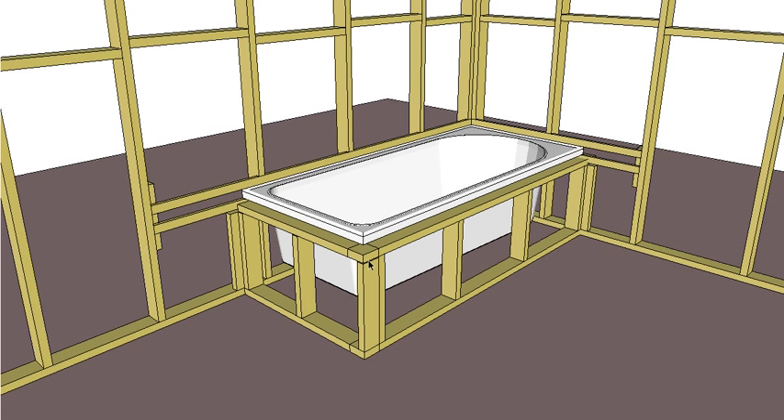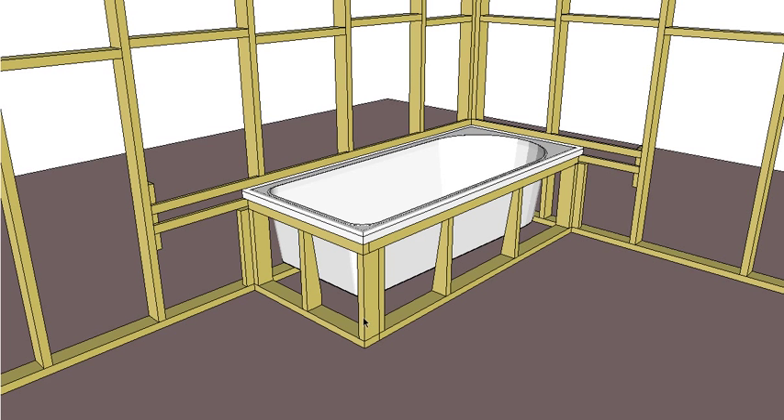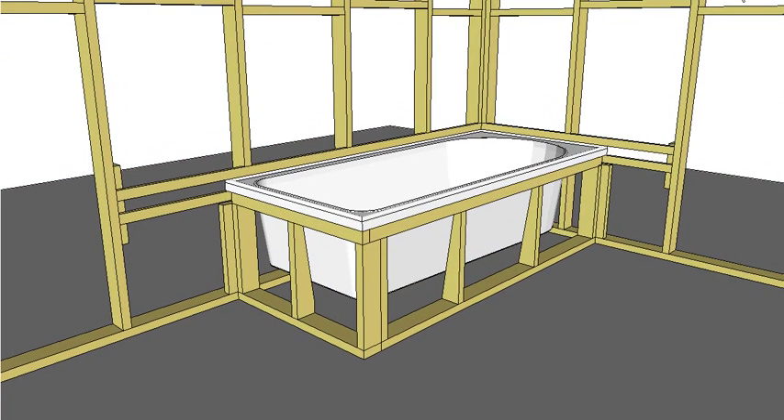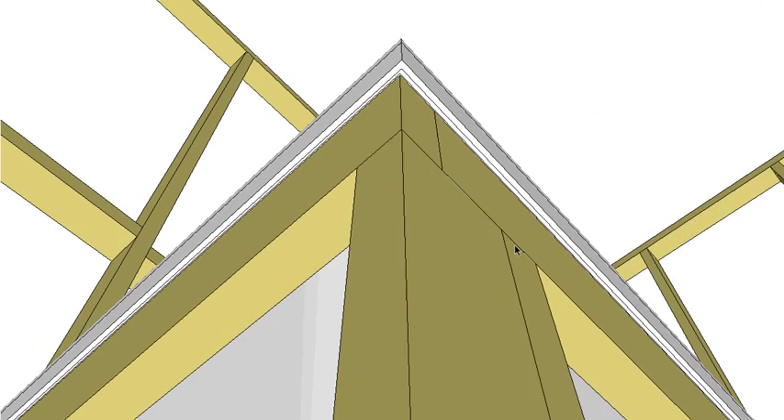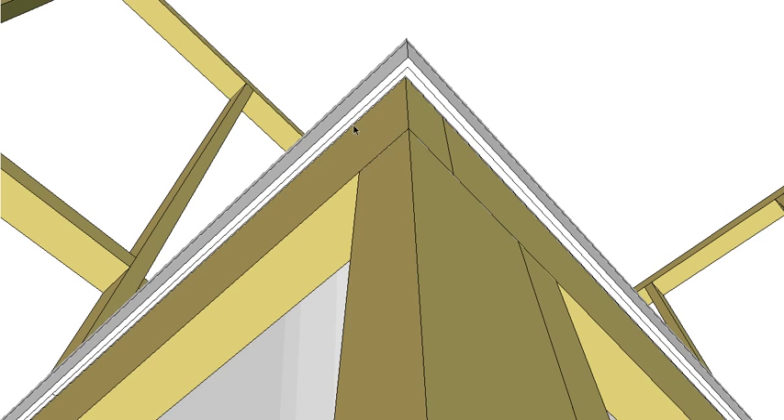Again there are two methods — similar to what we just looked at with the island method. That wall has to be high enough to allow for tiles, and you now need to allow for your villa board and your tiles to return underneath the lip of the bath. The other option is to finish the tiles flush with the bath, so the tile is actually tucked in underneath the edge of the bath. Let's dive in here and have a look — you can see that with this top piece, I've actually cut it and stood it on edge so it sits up underneath the lip of the bath, and that gives you your distance for your lining, your tiles, your glue, and everything else that's set back from the edge of the bath a little bit.